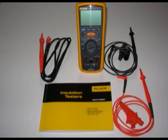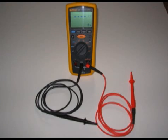You can also use it on the other side as an ohmmeter. It is a remote button that can be used instead of pushing the button on the meter. With the standard test leads installed, the meter is set on 500 volts to do an insulation test. That voltage will be applied for as long as you press the test button, or automatically for one minute or 10 minutes if the PI or DAR position is selected.